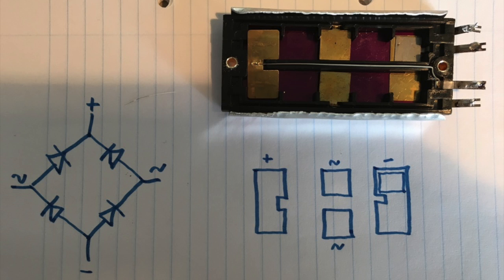You've got the unpopulated casing at the top. The lower left shows the bridge rectifier schematic we want to recreate inside the casing, and the bottom right shows the drawing of the pads as we have them inside the unit. The bridge rectifier schematic is very simple: four diodes, left and right connections for AC input, top is positive, bottom is negative. The way I like to remember this is that two diodes point to the positive and two point away from the negative. On the lower right, the pads are drawn: the one on the left is positive, the two central ones are the AC input points, and the one on the right is the negative connector.